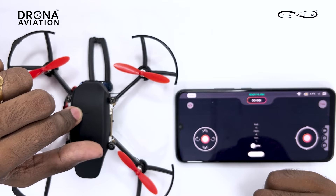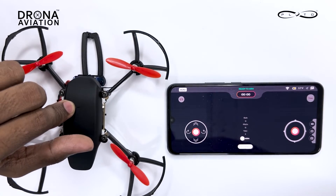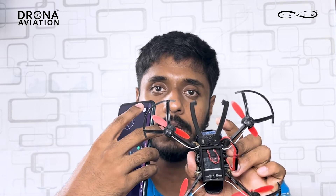There was a mistake I made previously — I said that when developer mode is pressed the gripper would stay closed, which was actually a mistake. Basically when you press developer mode the gripper opens and it closes. Also, at PWM 1000 the gripper does not stay still — PWM 1000 makes it open and PWM 1500 makes it close. So when you press developer mode it opens, and when you press again it closes.